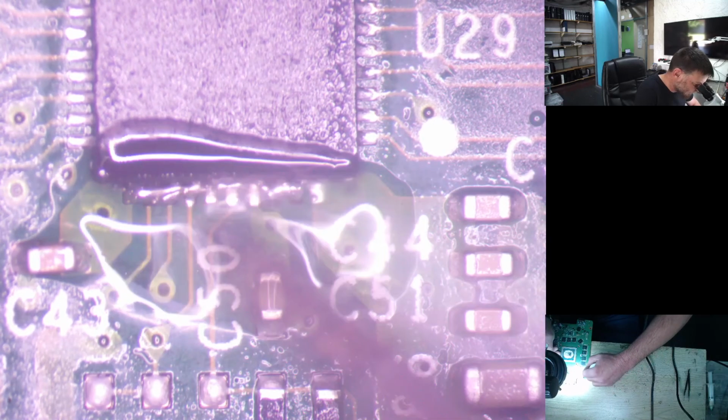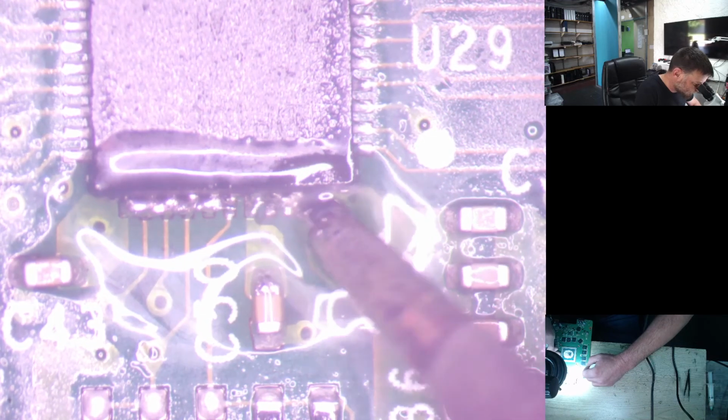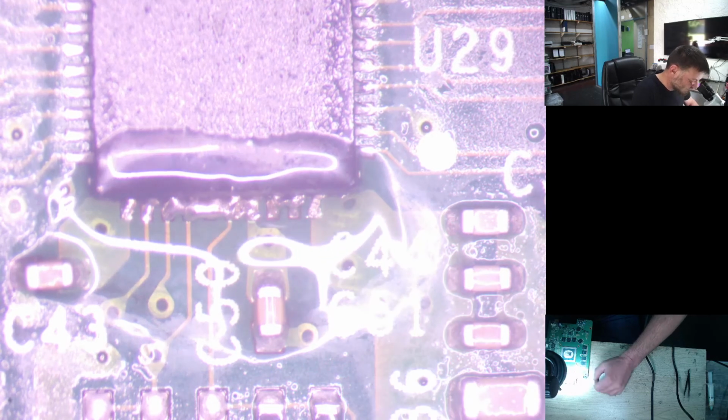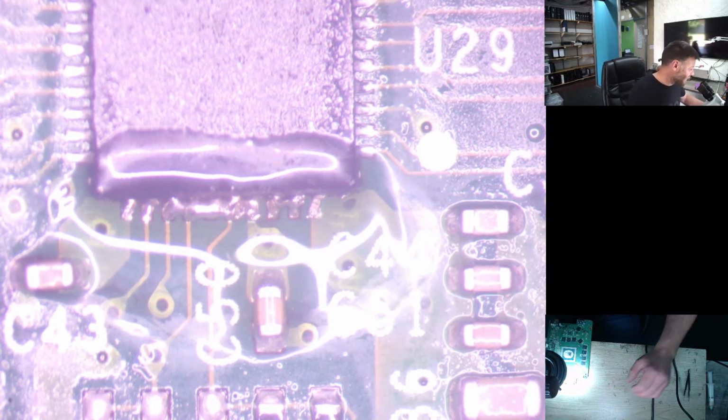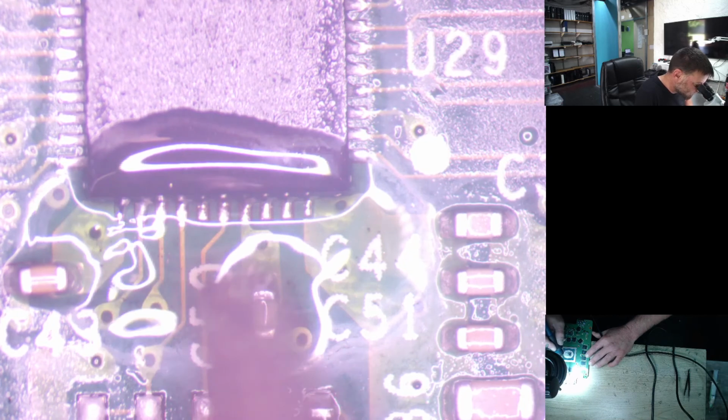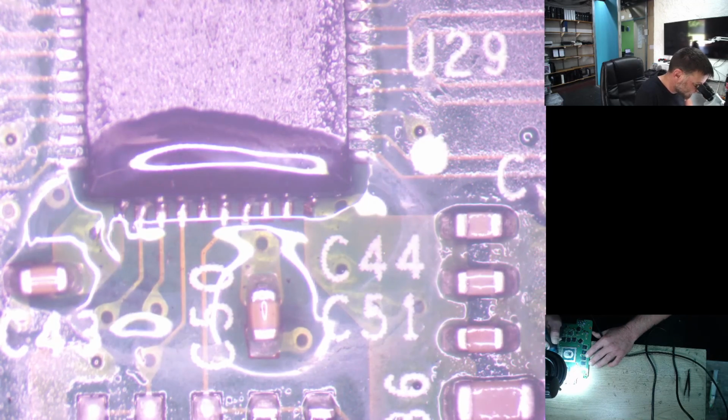Alright, so what often happens is you're going to get your solder clumping up, as it is with this one, because the problem is this tip may be a little bit too small and the soldering iron doesn't give enough heat. So that's why I run it with a fatter tip again. Just clean the tip to get all that excess solder off there. There we go, and that looks perfect. Better than factory, 100%.